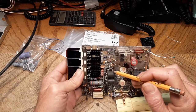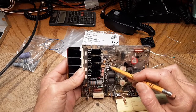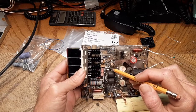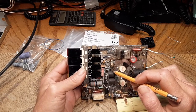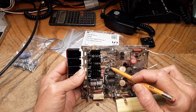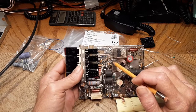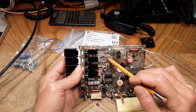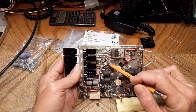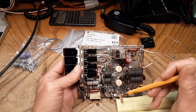Just going through this one, I kind of got a laugh because immediately I see there's a 4004 diode here - a 4004 diode is not a small signal diode, it certainly doesn't have any of the characteristics that small signal diodes do. There's also a 390 in here; my guess is somebody kludged that in. According to the schematic it's supposed to be a 470, but my guess is somebody had their hands in this and changed that.